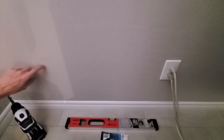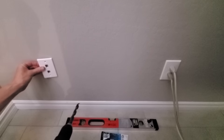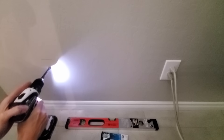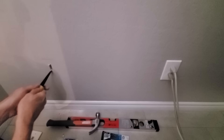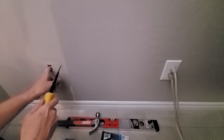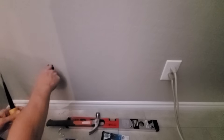So behind here — definitely a stud there, we're good to go. First thing I'm going to do is drill into here to find that wire. I do have a drywall saw which I'll use. As I always say, less is best when using a drywall saw. Take your time, remove some drywall, and only take away what you need — no extra. You'll need a big enough hole to grab the wires and also to install the face plate flat against the wall. We'll secure the face plate with some drywall anchors.